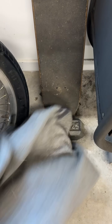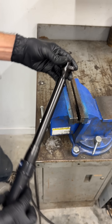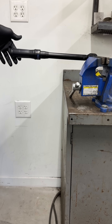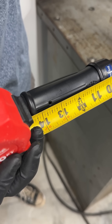To do this, all you need is one of those old weights that if you're like me, you'll definitely get around to using one day. Try to use one that weighs somewhere around the middle of the wrench's torque range. Clamp the wrench in a vice with the handle parallel to the ground. Because torque is a relationship between leverage and force, we first need to measure the length of the wrench from the center of the square drive to any point on the handle.